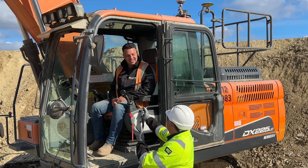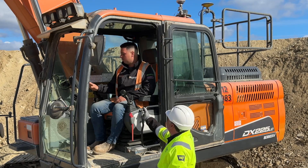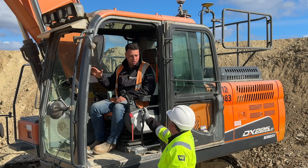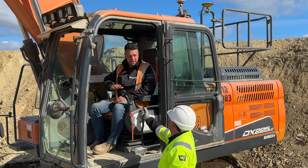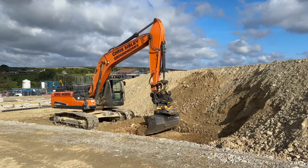So that beep — what's it telling you? It's telling me when I'm down to grade, when I'm at the right level. I've got the level of the lowest finished floor level, and then I put my own offset in for how far I want to go below the finished floor level — usually 150mm below the blocking beam. Then it's just dig the foot in and I haven't got to touch it again, just oversight and backfill.